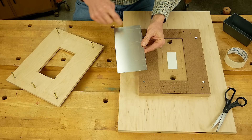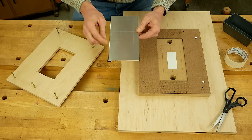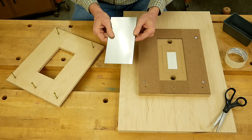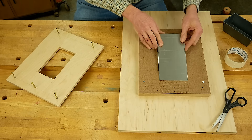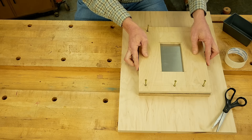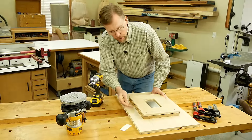So I don't have to apply a lot of extra clamps, I've got a piece of double-sided tape applied in the middle. That's so that when I route away the waste piece in the middle of the aluminum, it's held securely. These two holes give me a way to pop the plate out when I'm done routing. It's all held together like a sandwich with these top screws.